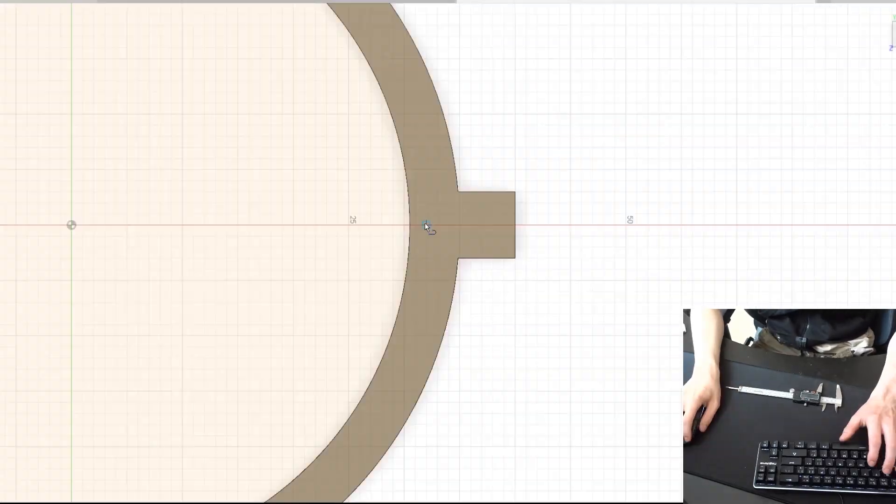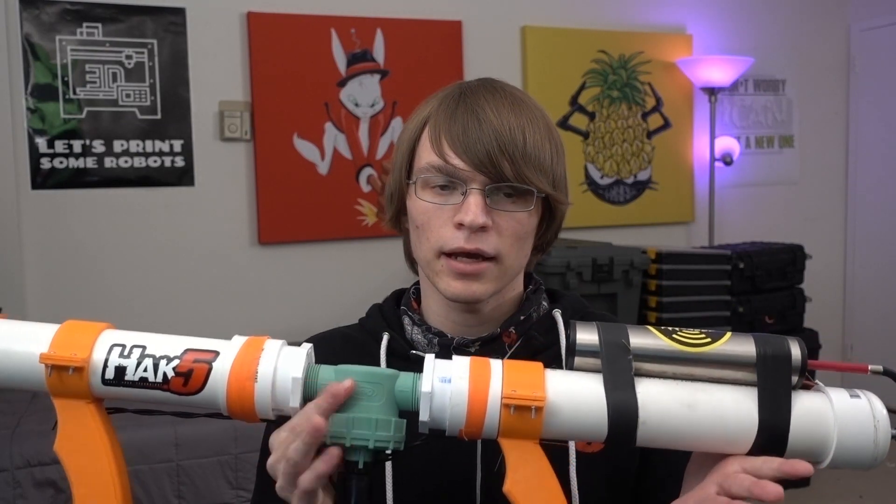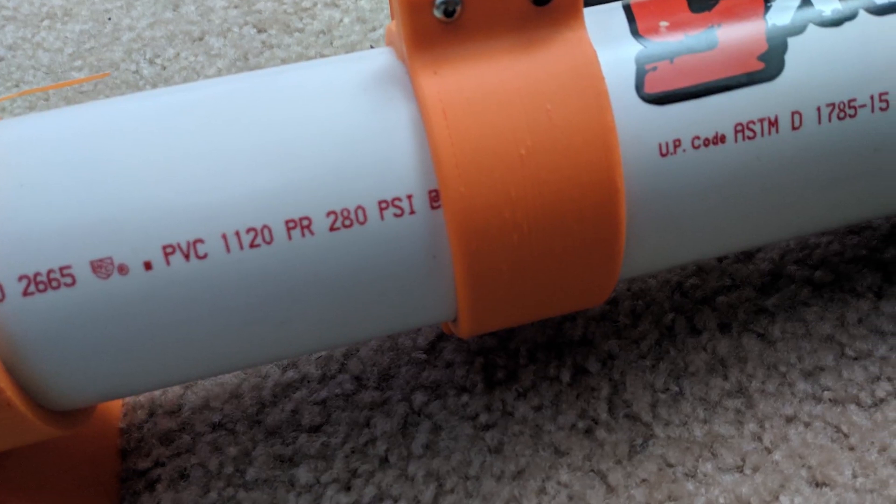Let me show you its features. This thing's actually pretty cool. It turned out really well, and it came together pretty quickly — I put it together in about 36 hours, including the time of designing the new brackets and letting all the adhesive and everything cure. Basically what we have here is Schedule 40 pipe rated at a max wall pressure of 280 PSI. I feel relatively comfortable running it up to about 90 PSI, which gives us almost a 3 to 1 safety margin, as long as you don't drop it. If you ever drop an air cannon, just don't use it again, because you can cause microfractures in the PVC.